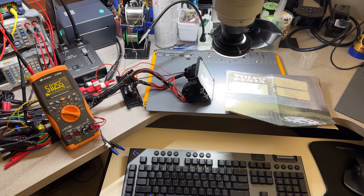So the first thing — let me show you the results on the curve tracer. It's a little blurry but we will see the results. As far as the curve tracer, everything is good. You can see that all the tests around the injector drivers pass. I also performed a test on the crank sensor signal which also passed. Everything on the board is green — all the injector drivers, injector pre-drivers, crystals, and diodes to protect the circuit are good. So I'm like okay, this is not what I expected.